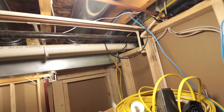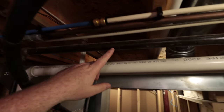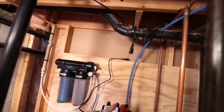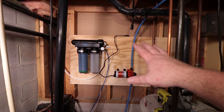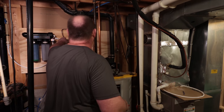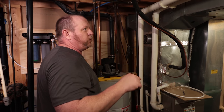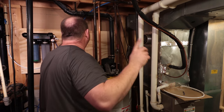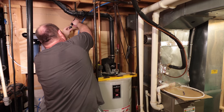Everything is completely done. Got the joint made, came back over, got the SharkBite apparatus in, running the PEX all the way down to the pump. Everything is all hooked up — moment of truth. This pump does have a pressure switch on it, so it will hopefully shut off once it reaches pressure. The valve is off at the brewery over there, so there should be enough water in the sump to build some pressure.